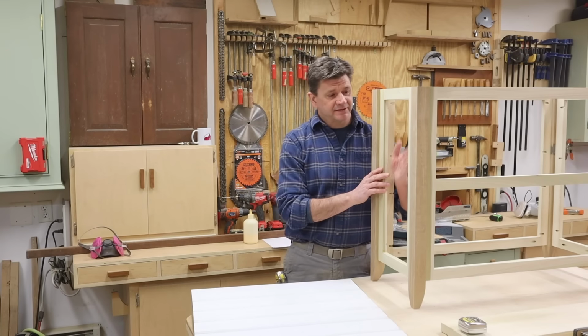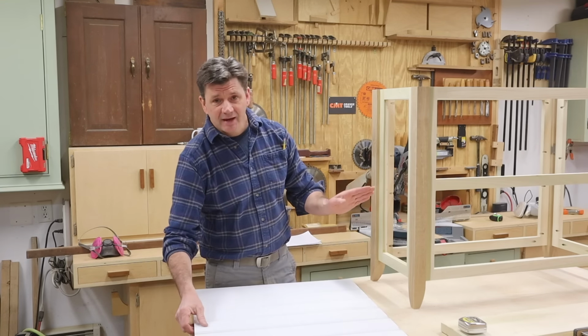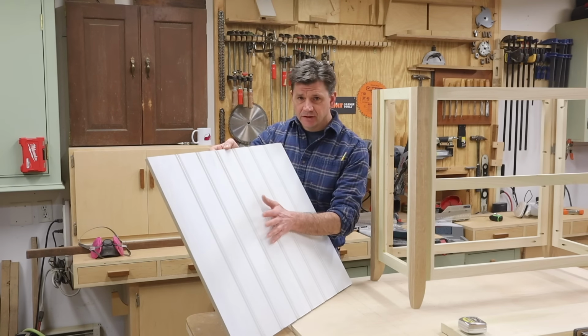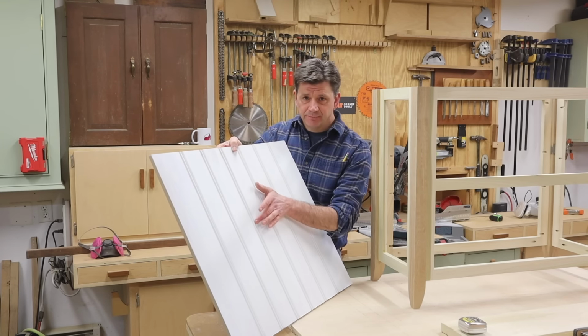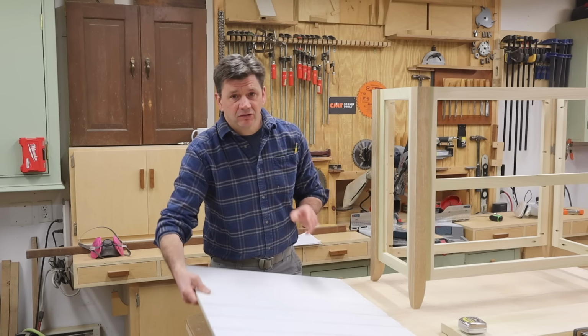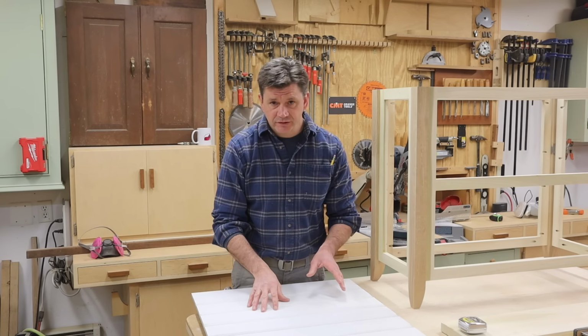Now that I have the cabinet assembled, I can add the flat panels to the sides of the cabinet, and since the cabinet is open, I'm using beadboard for the back. And I posted a video over the weekend on how to make this beadboard using the table saw and a hand plane, and I'll have a link to that video in the description, and it will also be part of the playlist for this project.